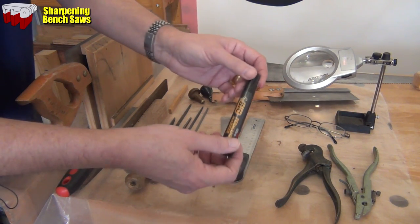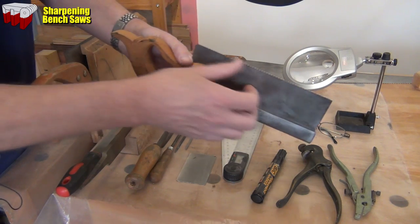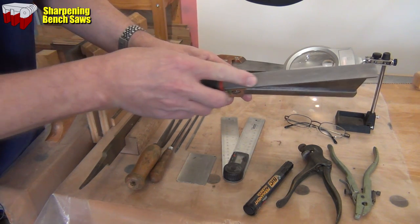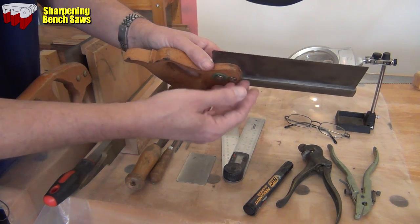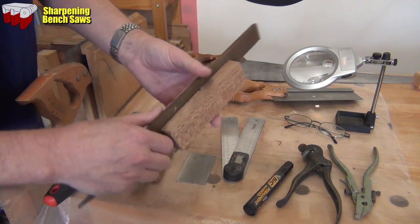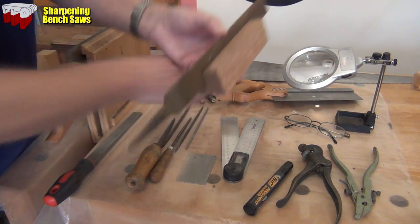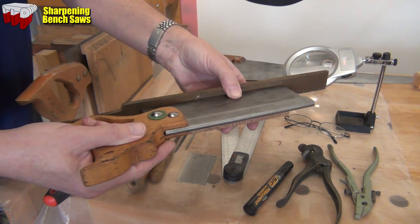I also find it's good to have a permanent marker - this comes in handy in two ways. First of all you want to make sure that your tooth line is straight, and that applies to virtually all saws in the workshop. If you put your permanent marker all the way along the blade and then run a file flat across there, it will remove marker from all the teeth as long as they're all in line and all nice and straight. If not, you need to level that tooth line and we do that using a mill file. I do it with a coarse mill file inside a block of wood. This block has a groove in it that holds the saw file quite tight and that gives me a right angle so that I can put my saw plate onto the block and then work it against the file. I find that the easiest method.